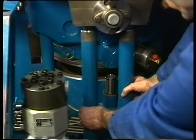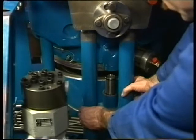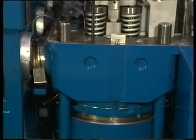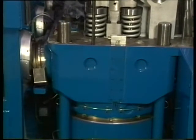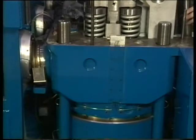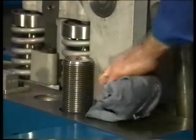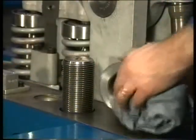Make sure that the cylinder head will also slide easily over the starting air connection pipe. By the oblique position of the inlet and exhaust flanges the cylinder head automatically takes its position. Make sure that the exhaust flange on the cylinder head fits in the lower clamping piece. Clean the surface of the cylinder head and the nuts thoroughly and check for damage before the nuts are being applied.